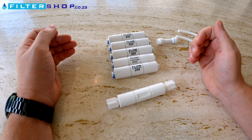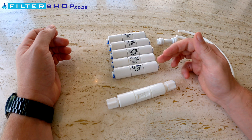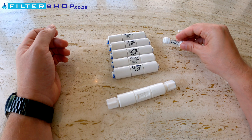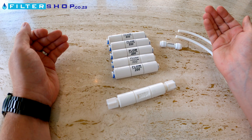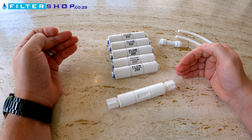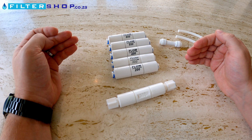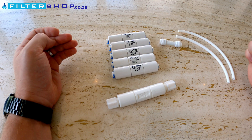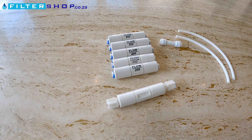So for example, if you have very low mineral content incoming water, you could actually go to a smaller flow restrictor like a 200 and then actually save water because the system would waste less water. If however you have a higher mineral content such as a very brackish water, then you want to start moving up the scale to a higher flow unit.